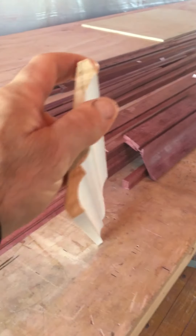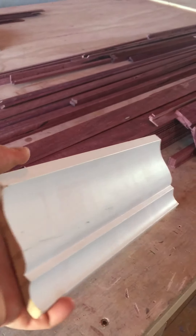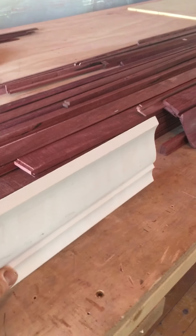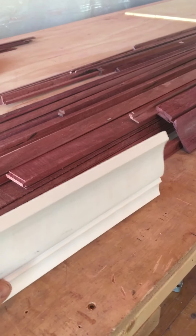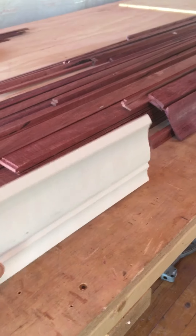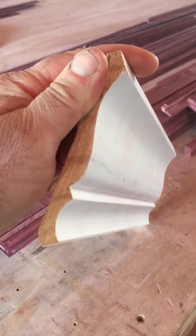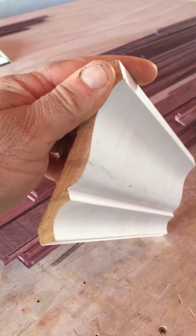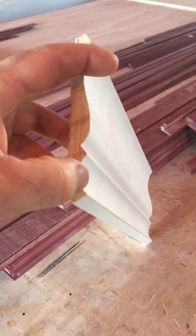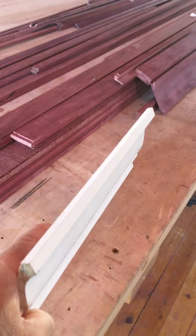If you look at this crown — which is probably the most common — this is a four and a half inch wide crown. We have three-foot wall cabinets and they get pretty high up toward the ceiling. We have nine-foot ceilings, so we knew we wanted a wider crown, but we didn't want this conventional profile — kind of a colonial style with a double curve and a cove at the base. The spring angle — how far it projects off the face of the cabinet — is 38 degrees.